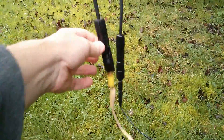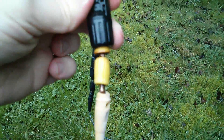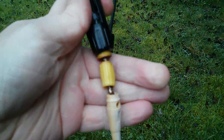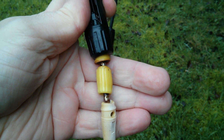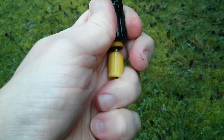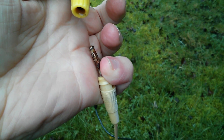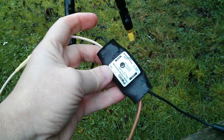It's not surprising really that this isn't working — look at the state of this, it's all melted. Because the connections were not very good, a bit rusty, what's happened is the connections have got hot, the plastic's melted, it's just a total mess. It's also all rusted up. I think I'll take this inside and do a quick check to see whether this charge controller is still working.